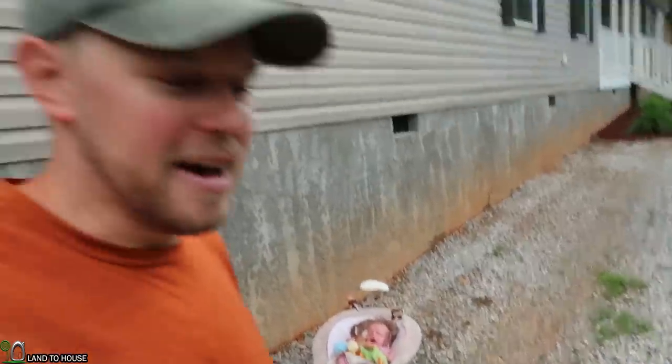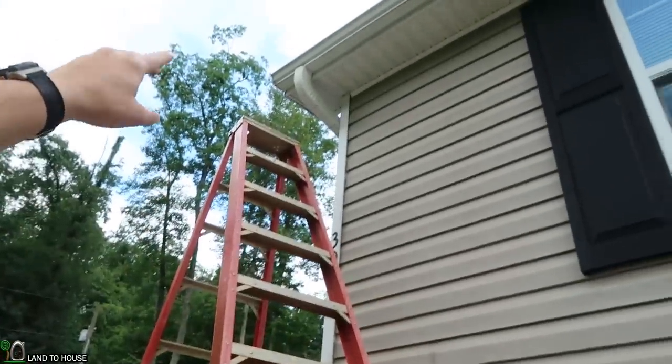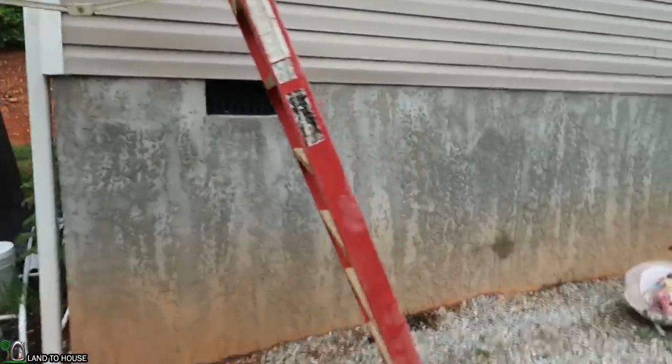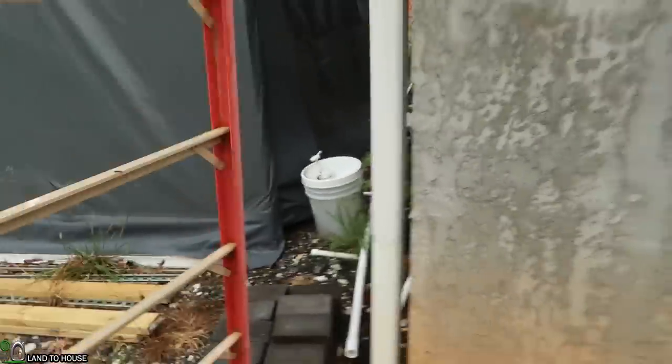The rain has passed — it's the next day. I've got Arrow out here and he is loving life. Ashley and Emma went off to an event and I'm taking him to the doctor here in a moment. But before the next bout of rain kicks in, I wanted to climb up the ladder and see if I can find a blockage in the gutter. Turns out it was just a small cluster of leaves that was stopping it, so now it's draining the whole gutter pretty quick. Problem solved.